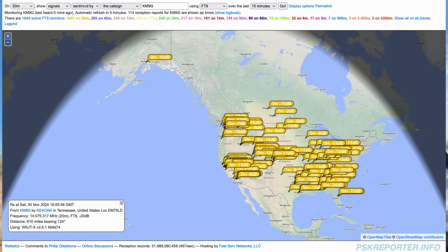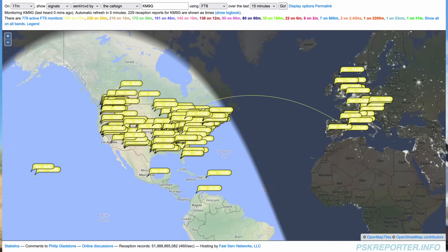Here's the 10-watt picture. Anytime I went above 10 watts I was running into RFI issues and the 705 and the amplifier were locking up and needed a restart. One of the things I'm really disappointed in the 705 about is that that happens often. I'm going to switch over to a different radio after I finish running through all the bands. We're on 17 meters and I'm getting 100 watts out with the amp. This is what the propagation map looks like on PSK Reporter — fantastic website — on 17 meters with the disc cone at the Titan Missile Museum. The first contact on 17 meters is M0BEW from across the pond, so working good — Arizona to the UK.